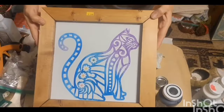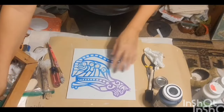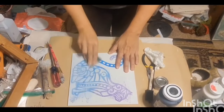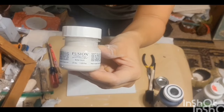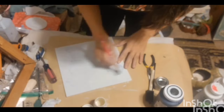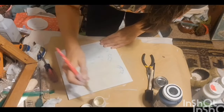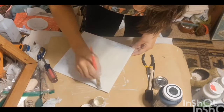For this project I have this frame with this painted cat on it — I had it in my stash. It is real wood, I love that wood frame, the color of it and everything. But we're going to change up this image here. So I'm taking a piece of 80 grit sandpaper — it's a really rough piece of sandpaper — and I'm just sanding over that painted image. Now I'm going in with my Fusion paint in the color raw silk and I'm just going to apply this paint over this entire wood piece. I end up doing two coats of that paint just to make sure that painted image was completely covered — I didn't want any peek-through or bleed-through of that bright paint that was underneath.